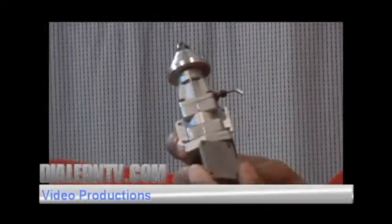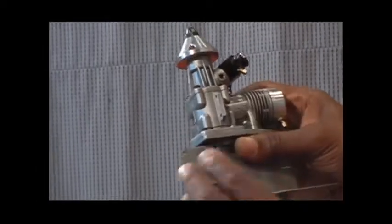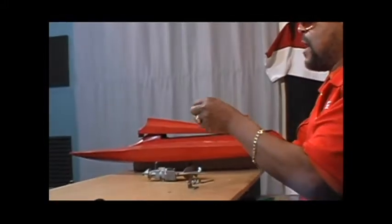Okay. This is an adjustable rear motor mount. This is the motor mount that we have here now. It's just a simple plate with four holes on it and a swivel left and right. The problem with that motor mount is once you drive the four bolts in, that's it. If you don't have the proper water level for the prop to go through the water, then you don't have any adjustment on this. You'll have to drill four more holes up and up and up. And really what you have in the back of the boat here is a whole bunch of holes. So you don't want to do that. That's why you get an aftermarket mount like this.